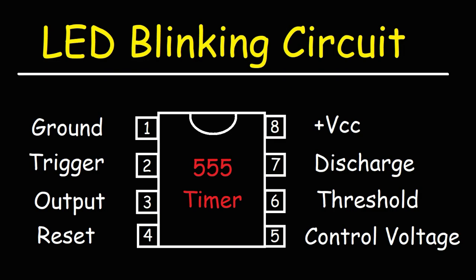In this video we're going to talk about how to make an LED (light emitting diode) blinking circuit, and we'll be using the 555 timer as the main element in this circuit. Pins 1 through 4 are on the left — these include the ground pin, the trigger pin, the output, and the reset. Pins 5 through 8 are on the right side. In this experiment we're not going to be using pin 5, the control voltage pin, which is useful if you want to create a voltage controlled oscillator.